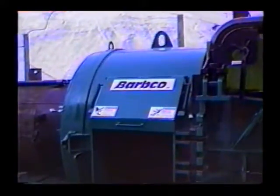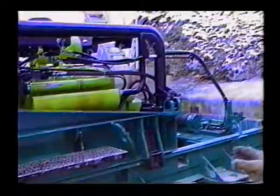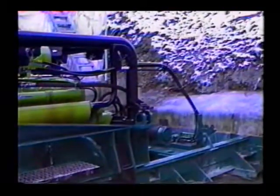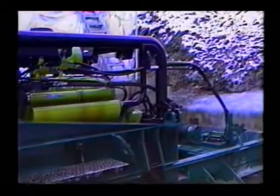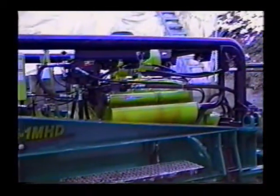It has four hydraulic rams in the back of the machine which we thrust off the track. It has a high-low — we can activate two hydraulic cylinders or four hydraulic cylinders. We'll start off with the two hydraulic cylinders, and as we build pressure we will then go to the four cylinders which will give us a million pounds of thrust.